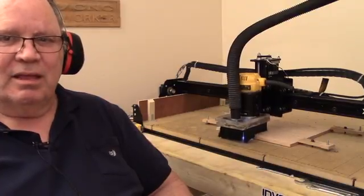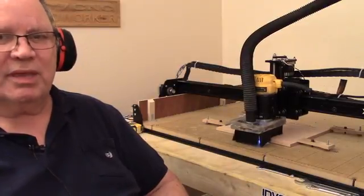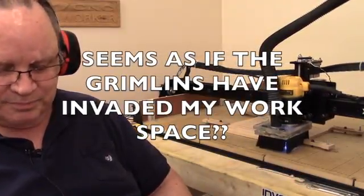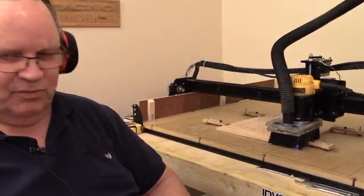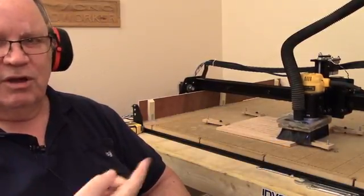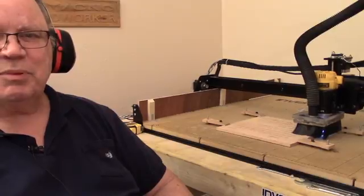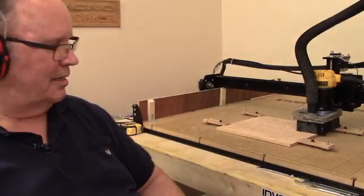So this time when I put that down, I'm going to put it down with a sacrificial wasteboard. And I will have the sacrificial wasteboard solidly mounted to the tabletop here. And then I will be using double-sided stick tape that I've used before to actually hold down the board when I'm carving. And it does carve the oval all the way around it and all the way through it without going anywhere. At least that's my plan. So we will see. Let's see how this is looking here.